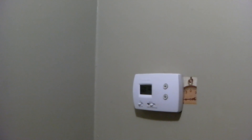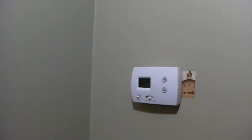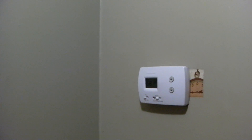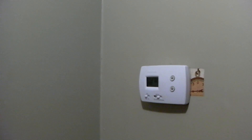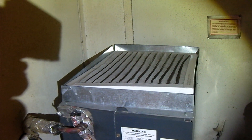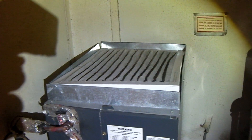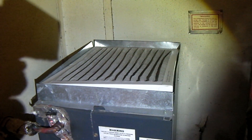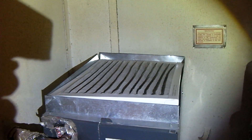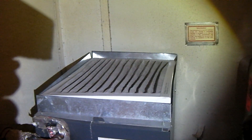Again, that's how you can test your backup heat — make sure it works. It's better to know that it works and burn off the nasty smell than to either wonder what that smell is or find out your heat is not working when it's cold. In addition to testing and burning the dust off your emergency heat, I also recommend changing out your filter before you start heating with your heat pump during the fall. I'd actually recommend changing your filter before you even start these procedures, so you're starting out with a fresh filter.